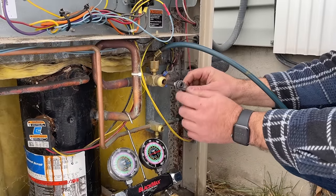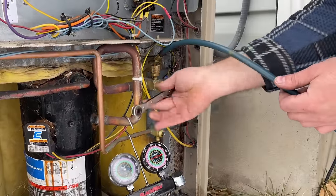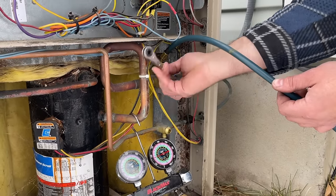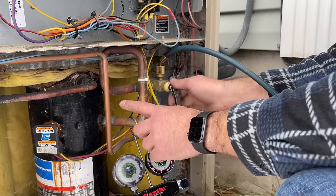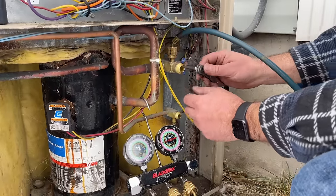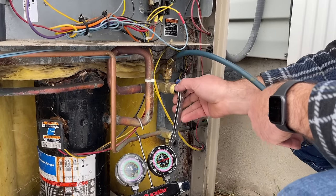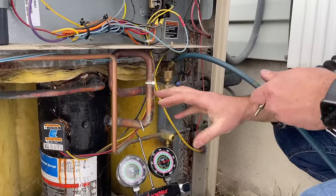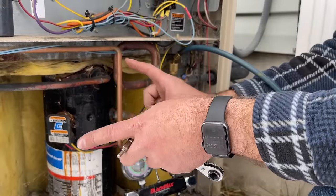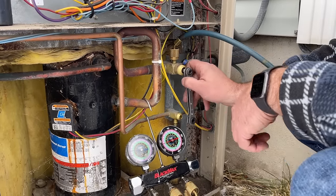The high side is fully seated. Next we're going to go over to the low side and do the same thing, except we're going to close it all the way and then back it off about 10 little rotations so we're still allowing a little bit of refrigerant to pass through the suction side. The suction side is labeled that because the compressor pulls the Freon through this suction line and forces it out as a liquid through the other side. Now that it's seated, we'll back it off just a few turns. This will allow us to use the compressor to pull all of the refrigerant from the evaporator coil through the suction line — it'll stack inside the condensing unit coils and won't have anywhere to go. We'll monitor this on our gauges and once we hit zero, we'll close this down all the way.